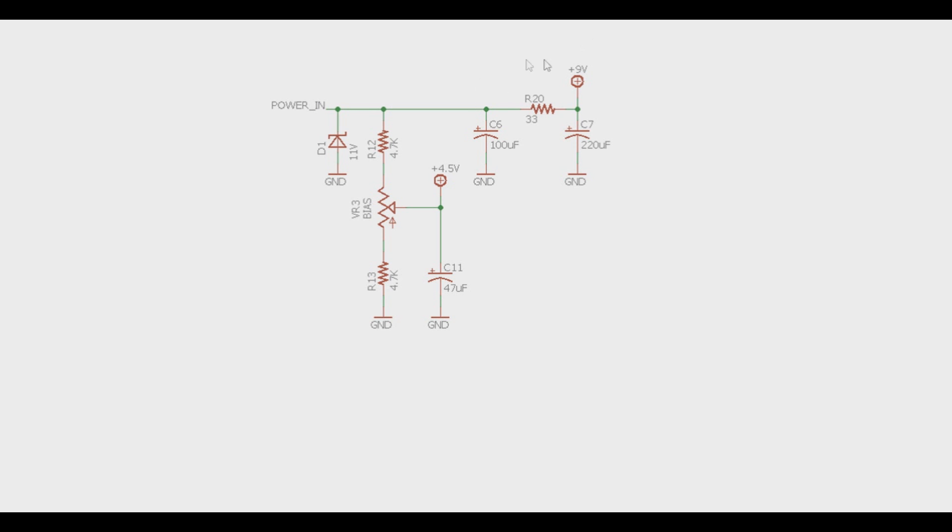We have a filter here — this is an interesting way of tackling noise coming on your 9-volt rail. This is what is known as a PI CRC second-order low-pass filter, set up to basically cut off drastically after 22 Hz. This is basically so that you reject any high-frequency harmonics, which are specifically really bad for BBDs and accentuate the clicking noise that your clock driver might be creating.